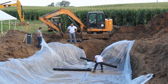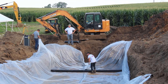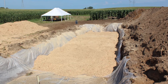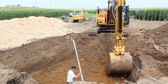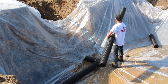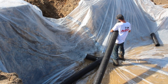When the water flows into the bioreactor, it goes into a distribution manifold — a perforated pipe that distributes the water across the width of the bioreactor. The water passes through the wood chips in the bioreactor, and we want the water to be in the bioreactor long enough to be treated, but not too long. So the bottom of the pit is sloped just a little towards the downstream end of the bioreactor to allow the water to drain out after being treated. A second perforated pipe, called a collection manifold, is set across the width of the pit at the downstream side to collect the water after it has made its way through the wood chips.